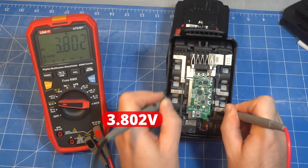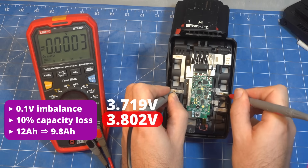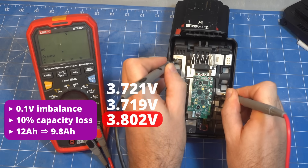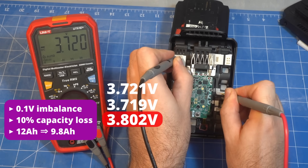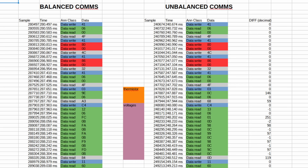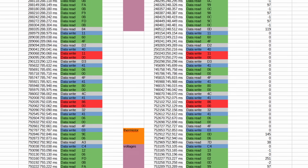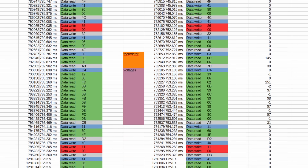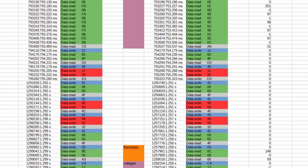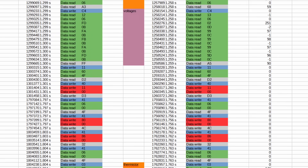To see if balancing was happening, I manually charged the first cell 0.1 volts higher than the others. That may not sound like a lot, but that represents a 10% loss of capacity, so this is now a 9.8Ah battery. After adding this imbalance, I'm not seeing any messages that look like turning on balancing transistors — in fact, there's no change in the communication at all, which isn't a great sign. This chip does have its own microcontroller, so it still could be doing it without needing to be signalled.